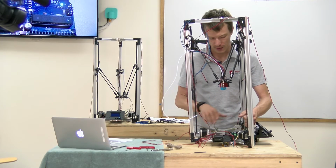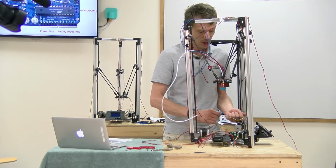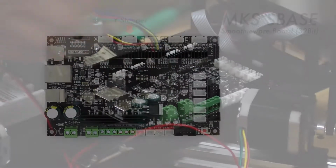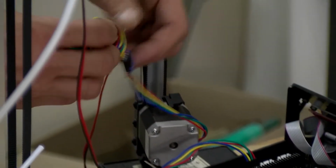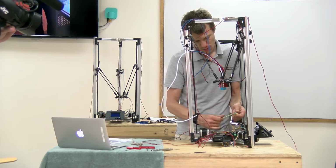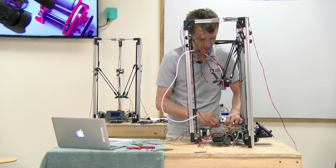If the motor is going the wrong direction, or you need to reverse the direction of the motor for any reason, all you need to do is switch the orientation of the wire. But make sure you do this when the machine is turned off and the motors are not running. As always, if you'd like to see diagrams of the wiring, check out the Blue Eagle Labs website and wiki pages. I'd also recommend making somewhat of an effort to keep the cable management under wraps now.